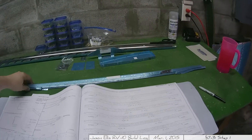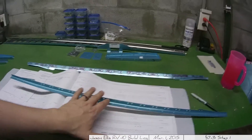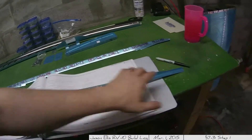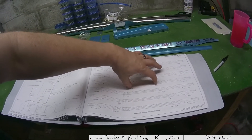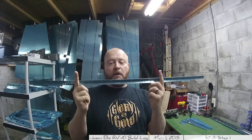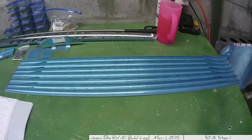"Chunks" being a technical term, of course. This is a good example of something that's going to take a fair amount of time — not terribly difficult, just measure, mark, and cut — but there's a lot of cutting. We cut the ends on each piece and then cut in the middle, and each one gets progressively larger. The nice thing is that leaves us a center area we can use as a dummy or test area for riveting practice or general abuse. Now I've got them all marked up — let's go cut them.